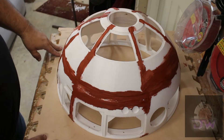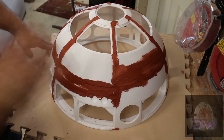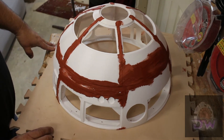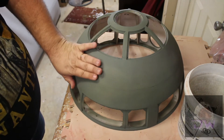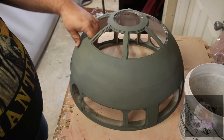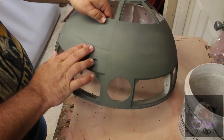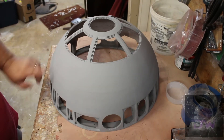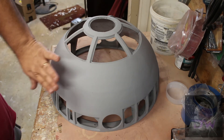Quick tip on assembly: lower dome one and mid dome one line up — self-explanatory. After gluing the mid and lower domes I used filler on the seams. This was a mistake because I should have used Bondo first for the major gaps, then filler later for the finer details. The first coat of paint can be regular primer, two-in-one primer, or self-etching primer — which is what I used. This is a great way to find all the spots that need more attention, and I had a lot. I didn't show the next layers of filler, sanding, or two-in-one filler primer because it's hours of boring repetition.